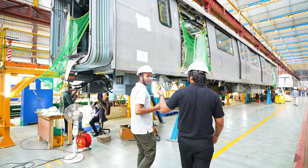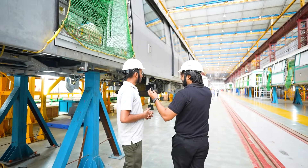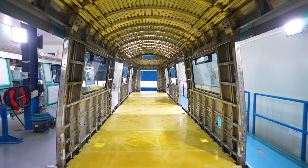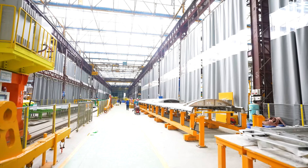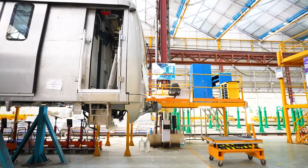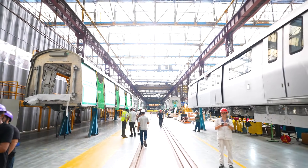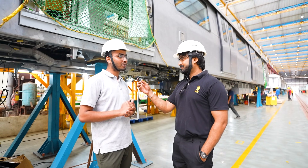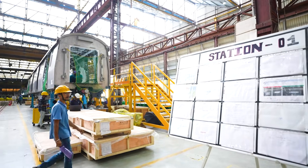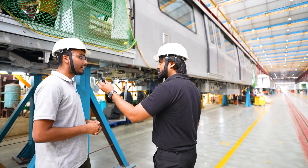When the bare car body comes from the car body shell, we have to furnish it from interior and exterior fittings. In the interior you look after some interior panels, seats, and lighting activities, and in the exterior we have some underframe equipment, roof, lights, and cab masks. These all basically give function to a bare car body and give comfortable service for the coaches. All these outfitting activities are defined as very precision activities which also have aesthetical looks — in the sense of metro coaches. This is Station A01 where we perform all our insulation activities which protect from vibration and sound dampening.